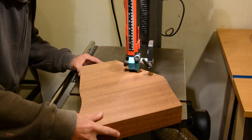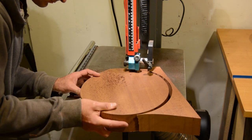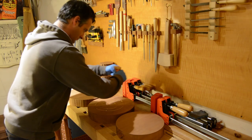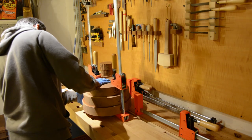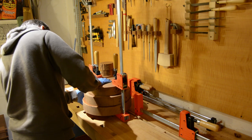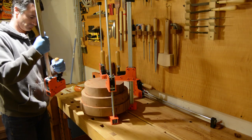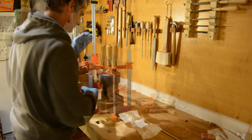I've used a compass to draw out the seven individual shapes of the laminated pieces. I move to the band saw and cut away the waste. With all seven pieces cut, I move on to the glue-up. For the most part, stacked lamination is easiest done in stages. So for this project, I start with layers one through three and glue those up, then move on to layers four through seven. Once these are all dry, I glue them together as one continuous piece.